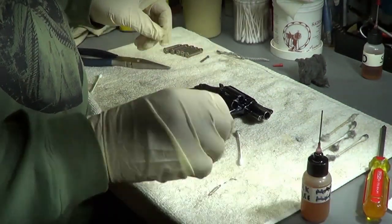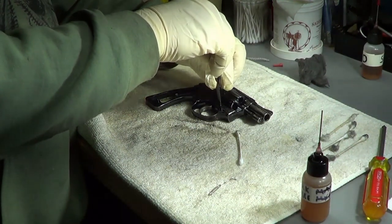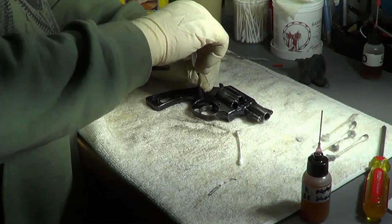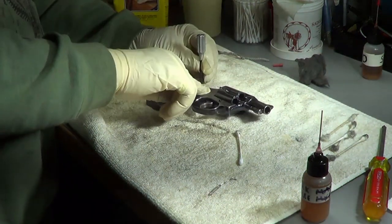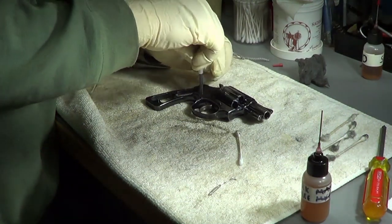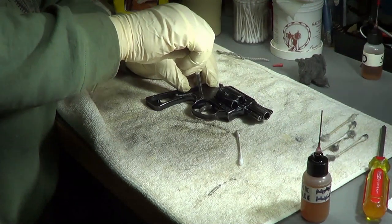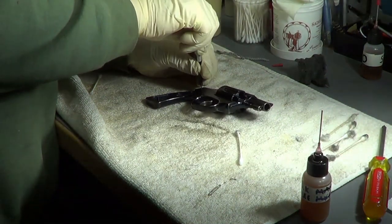Alright, I'm going to just start these by doing reverse threads. I heard that click - I know it's threaded right, I just went about a half turn reverse thread. Get that started - reverse thread. I'm not getting a click here - there it is. So now I'm just going to circle them down to where I get resistance. Resistance - half turn, half turn, half turn, resistance.